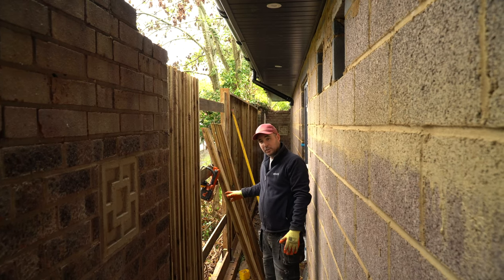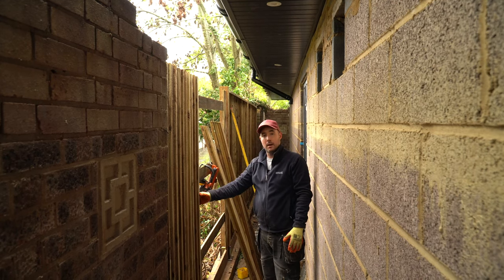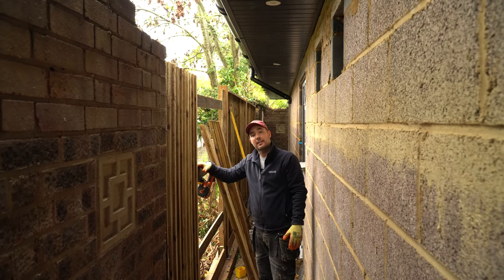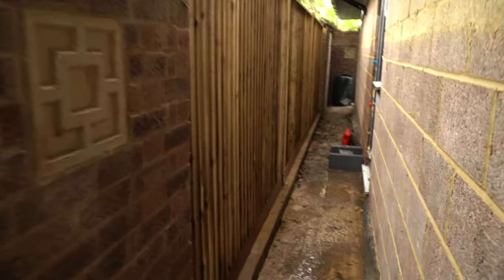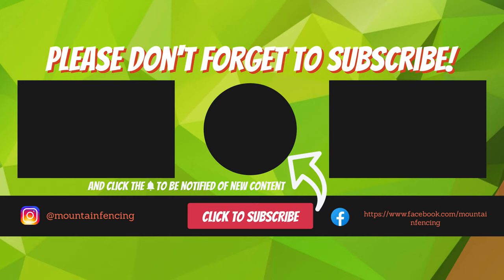Once you've put your posts in and your rails in, you want to put your gravel board, center stump, and then do all the feather edge boards — but I'll go through that in more detail in another video and leave a link up there. That is just one way of how to install a fence on top of a brick wall; there are many other ways and I will make videos for those as well. Stay tuned, don't forget to like, give it a thumbs up, and subscribe — thank you very much, see you next time.